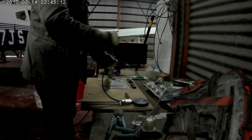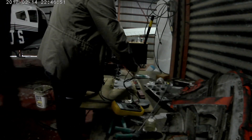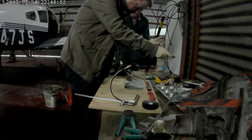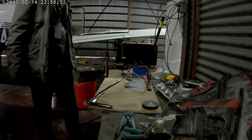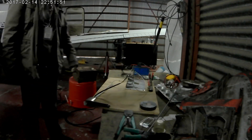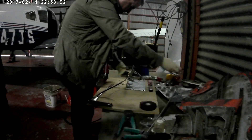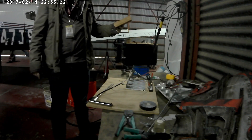But here we are on the test stand — everyone remembers this from the LEDs. I just went ahead and put in a 10-amp breaker, because the 12-volt power supply we actually have hooked up to our arrow is on jacks behind me — a little gear leak issue. So the 12-volt power supply is over here. What we're doing is hooking up all the heaters at once. There are two heaters in the pitot tube — two 100-watt heaters.